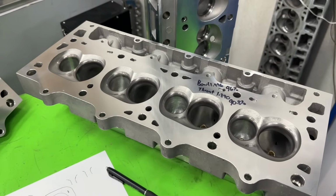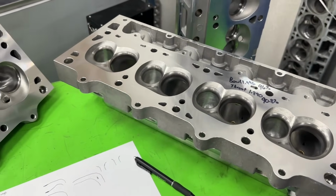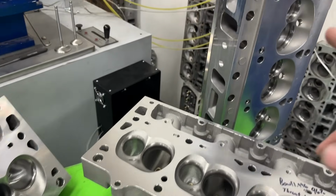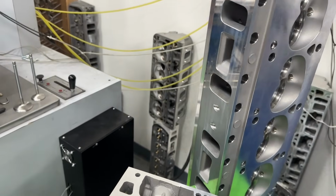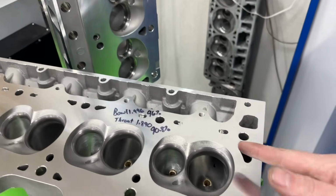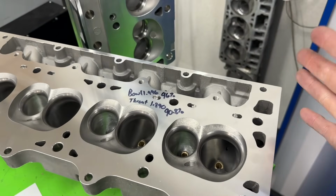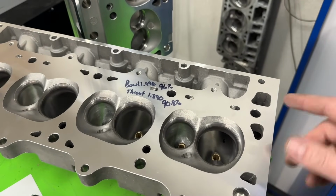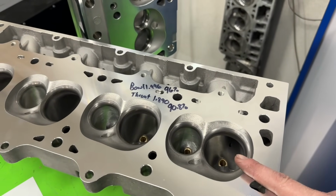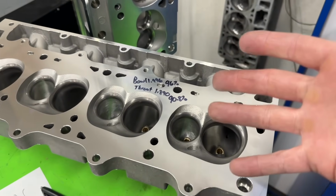If you're ever wondering how some small engines or small cross-sectional areas that are choked out get to turn more RPM, like super stock stuff, they add duration. If you can't add airflow, there's a certain point where you can't add any more area because of rules. The only thing you do is leave the valve open longer, so it pulls more to get more in there.